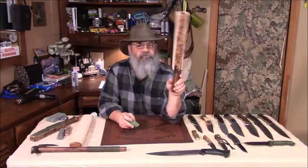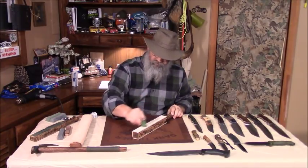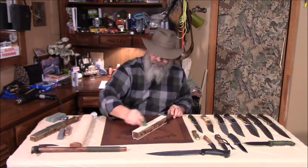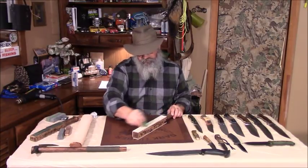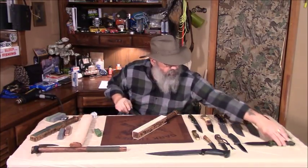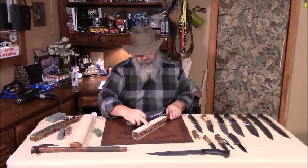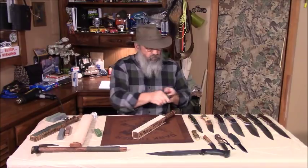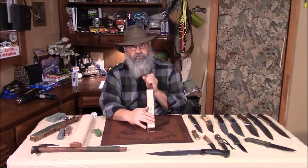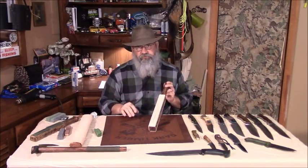We're going to work on this tri-strop to begin with — Brad, awesome job, brother. You can take this strop and just start coloring it up with the compound. However, you're only putting compound on the very surface that way. When you take a 1095 high carbon and start working it, you're almost dragging the compound right back off. What you want to do is get that compound into the leather — get it embedded, impregnated — so you can't scrape it away. It's in there.